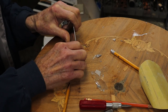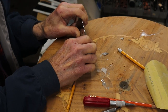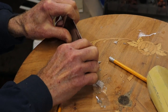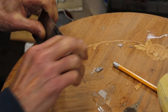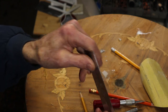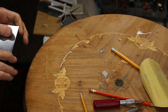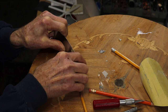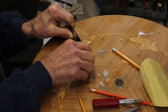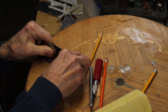Now a little more scraping just to level things out. Again, too aggressive sanding might go through the veneer — it's very thin. This is not a high quality table; it's some kind of import. This is my thinnest card scraper and it will bow. When you want to concentrate on a certain area, you want to bow it and bear down right in the center to avoid scraping the edges off the veneer adjacent to the piece you're trying to bring down.